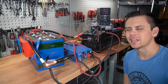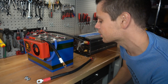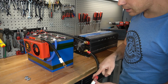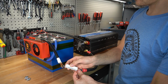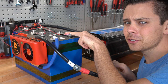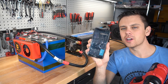It's been quite a few hours and it's pretty late, but I really want to do this test. It's fully charged, so let's fire it up. This inverter is huge, so we're going to pre-charge the capacitors with a little resistor. Always attach the large conductors to the inverter first and then connect the battery — I see people do it the other way around and that's very dangerous. We now have 3,000 watts of heat gun power, which divided by 12 volts is exactly 250 amps.